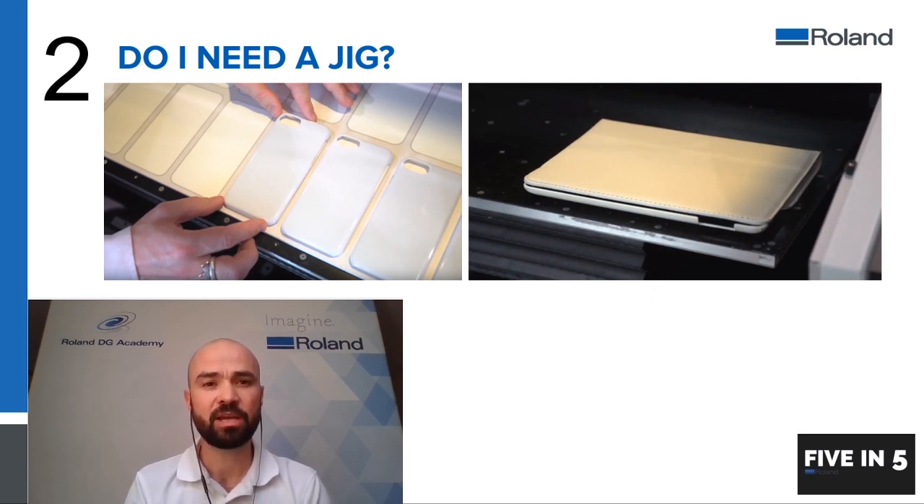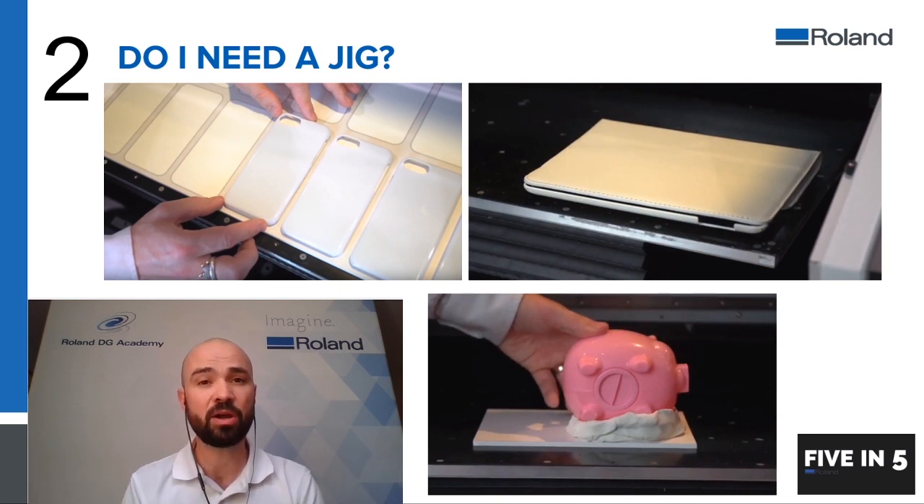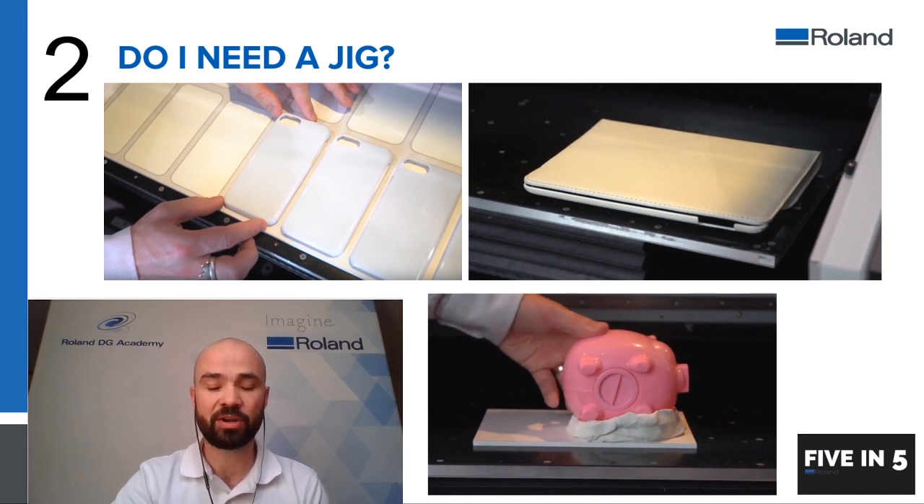The image on the left shows a template that doesn't have any cutouts, so items don't sit within the jig — they just sit on top of the template. This is a very simple form of a jig, but if your item does not move around and is not an awkward shape, it can just be placed in the zero-zero position on the X-Y axis on your table and your software will be used to line that up. If you are using items that are very strange in shape or that tend to move around and need a recess to sit into, then a jig can be used — and as you can see in this image, we've actually just used a bit of putty to hold that item in place.